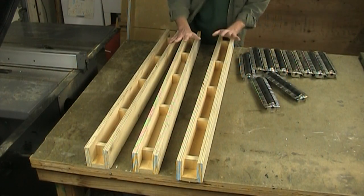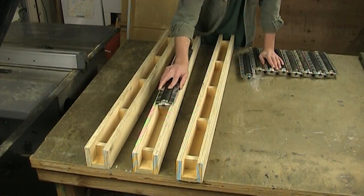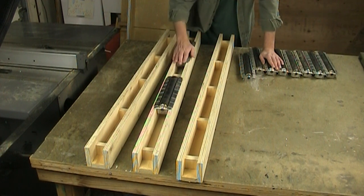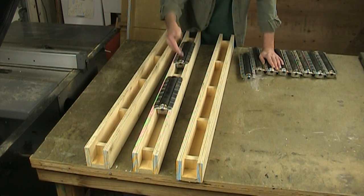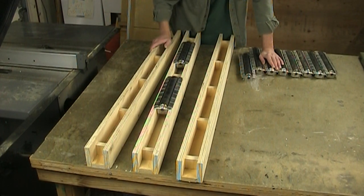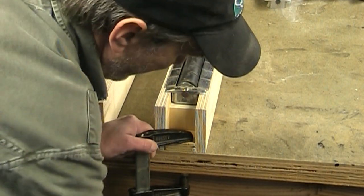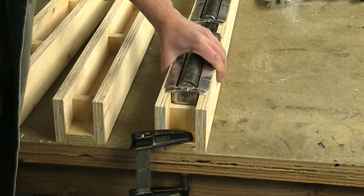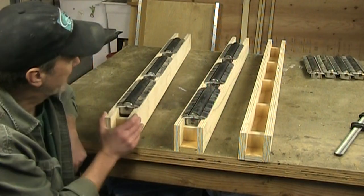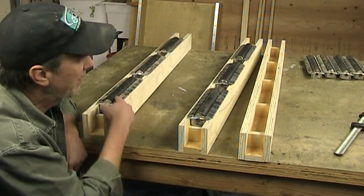Here's what I've done. I've made three of these little roller stands that the rollers can just drop down into, and I can move them around wherever I want. I don't even need to screw them down, and they're at the same height as my table saw. I've left a little area on the end where I can just clamp it right to my workbench so it won't move. I can use them wherever I want depending on the size of wood I'm running through my table saw.